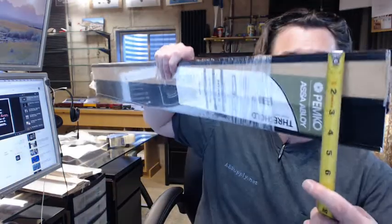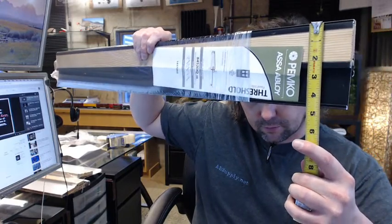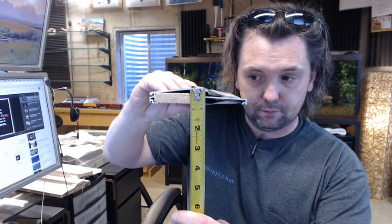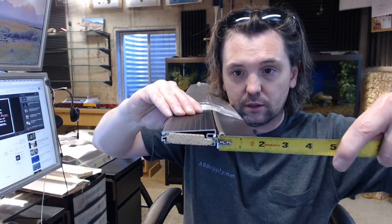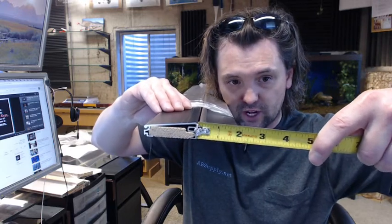You can see that the threshold from that drawing is 4 and 9/16 inches wide. We have an overall height of 3/4 inch. They give a projection of that Q-LON at 3/8 of an inch, and that certainly is the case — it's a typical size for that material.